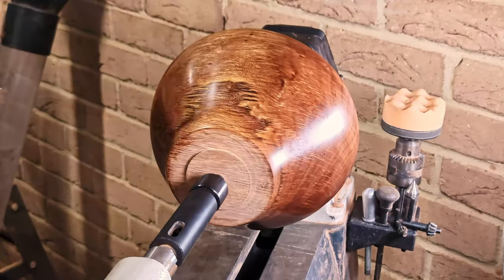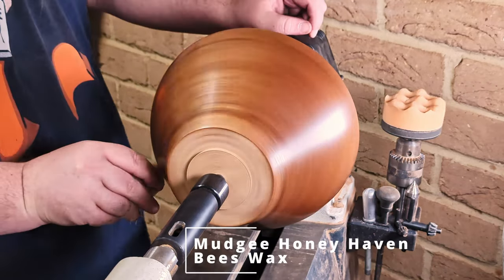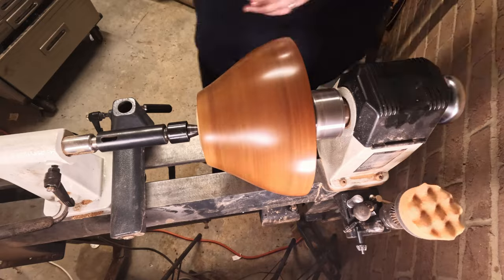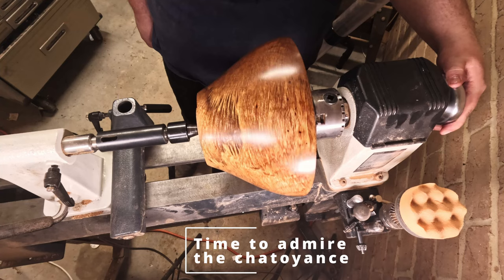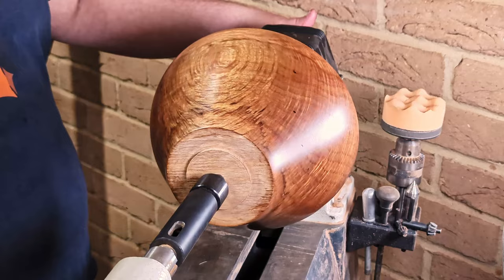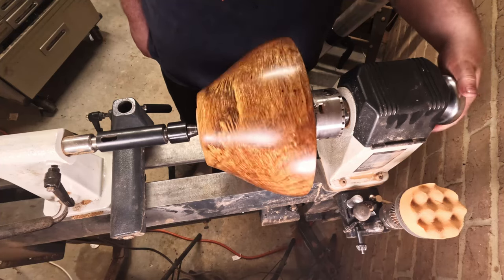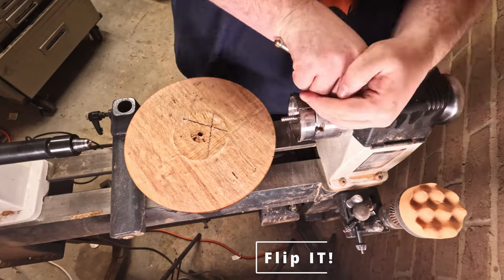Here I am applying the first layer of oil and then buffing it out. This is the same finish as I did on the bowl a couple of weeks back with the claret ash — I do three layers of the chopping board oil and then I burnish in some wax. At this point I really start to notice that golden shine on that corner, and I wanted to try and emphasize that to show you because this made me very happy with how much quality is in this wood.